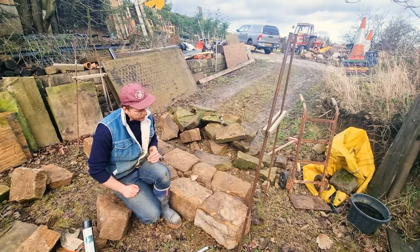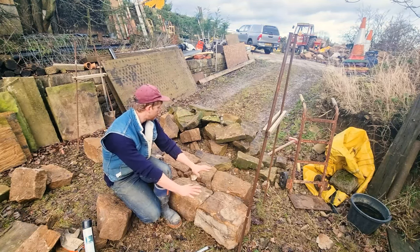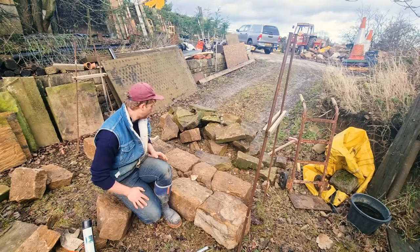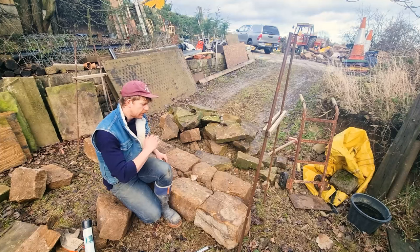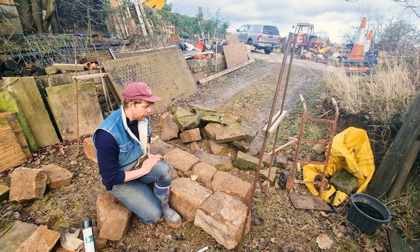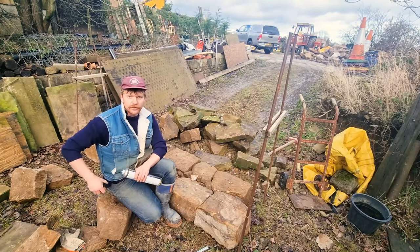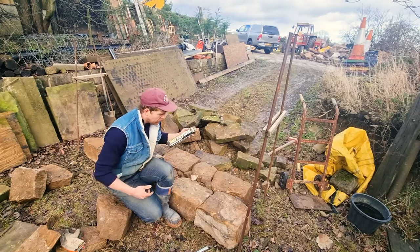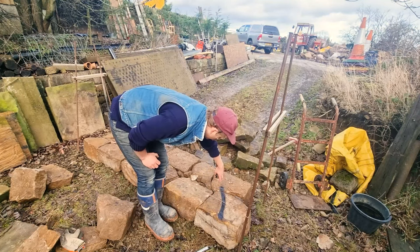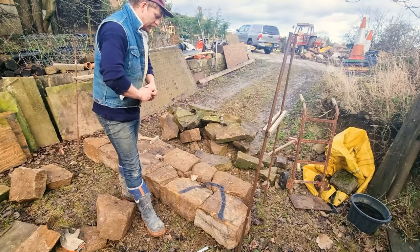So I'll be starting at the first place where I'm going to wall a stone, at this lower end. There's a slight slope, I'm at the lower end here. The footing that I put on is going slightly uphill, so I might try and level that out. Now, I'm going to mark on with paint the ideal stone that I need. In an ideal world, I'd have a stone that went halfway there, crosses onto the back there, then comes halfway to that stone.